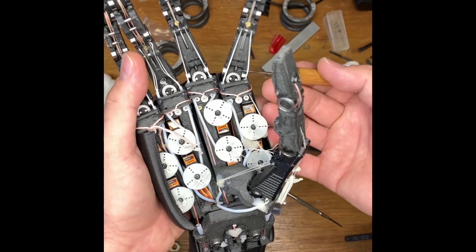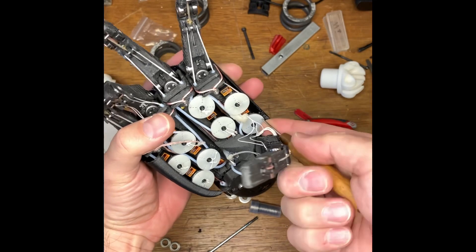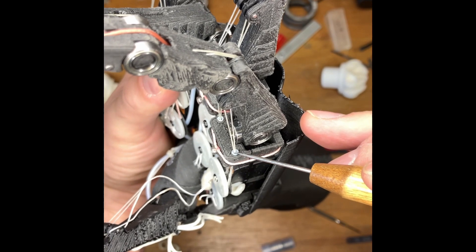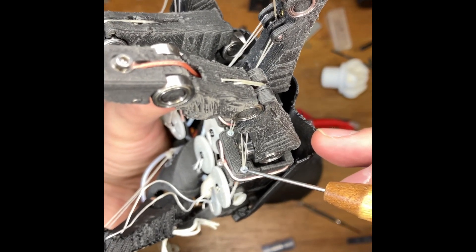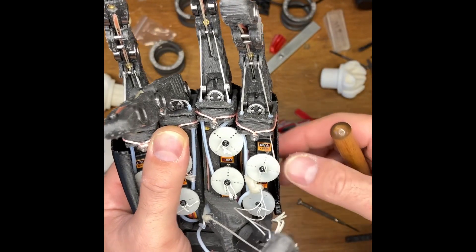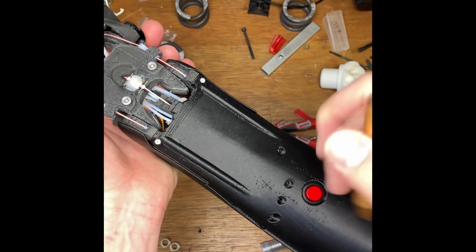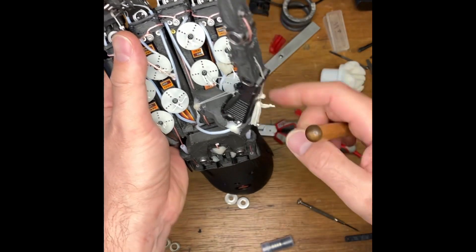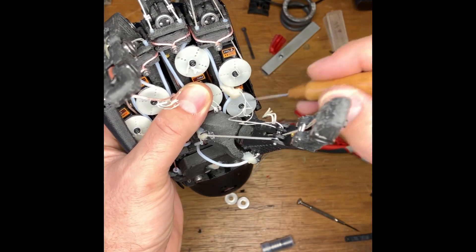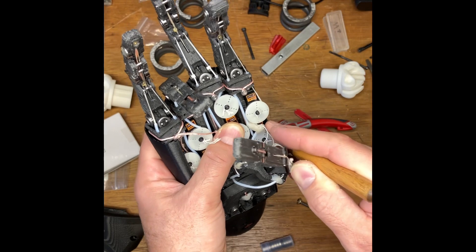In this case that's outside and inside — one wound from here, one wound from there. The tendons themselves pass through pretty tight-fitting Teflon eyelets there and there, and the long ones, which are inside the hand, pass down this Teflon into servos which are inside the forearm area. Simply, as these motors turn, the finger moves.